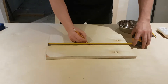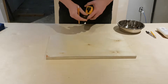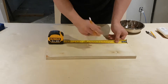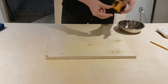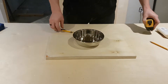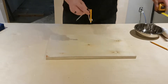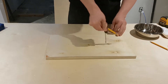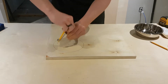I had this piece of plywood laying in my scrap pile for a while — it was an odd size and I didn't really know what to do with it, so this worked out perfectly. First I'm finding the center of my board, then finding the center of each half. You can adjust the spacing depending on the size of your bowls. Then find the outside and inside diameter of your bowl so you know approximately how big to make your hole. Take your compass, set it to half the total diameter of your bowl, place it on your center mark, and mark out each hole.